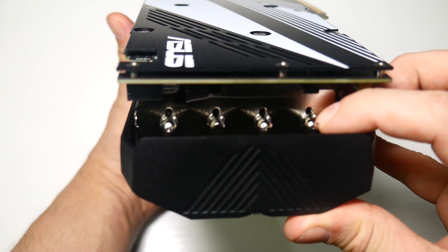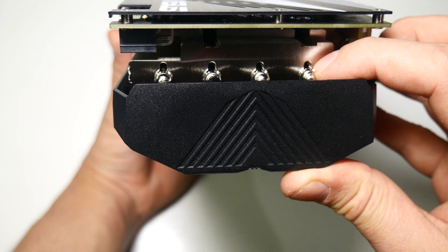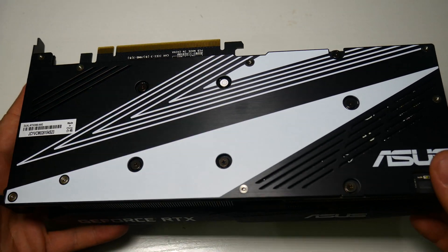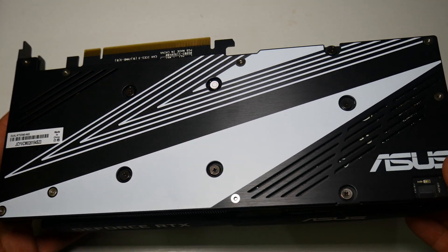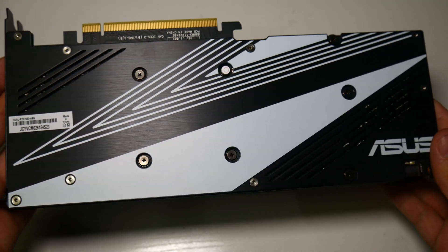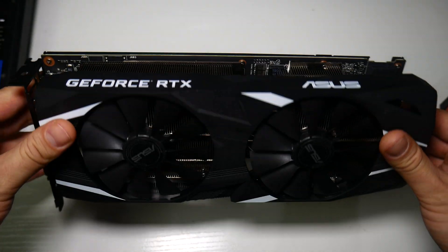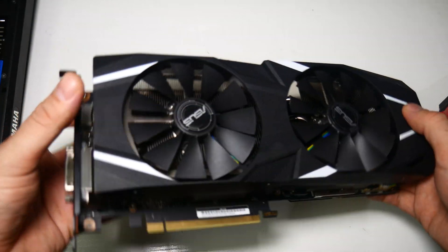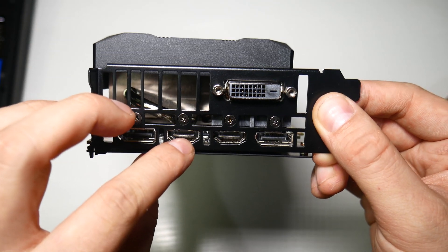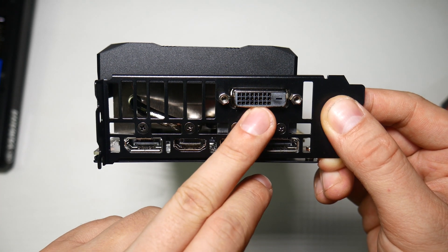I think they're probably 4-6mm copper heat pipes, but they're almost looking close to 8mm. The backplate also looks fantastic. When we looked at the Palit card, we thought 'doesn't it look basic?' — although it was a faster clocked card than this, it did look very basic indeed. But I'm loving this white and black plate — this whole thing looks absolutely fantastic. All black PCB, and then we have an all-black IO cover. We have two HDMI 2.0b ports, two DisplayPort 1.4s, and a DVI-D port.